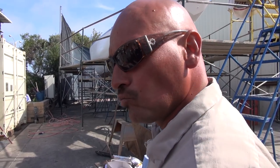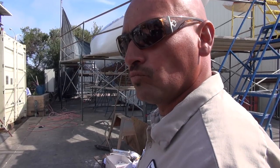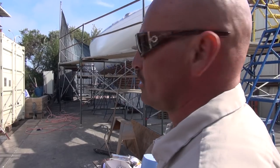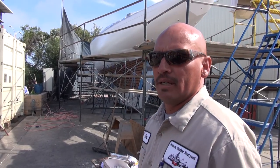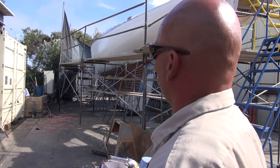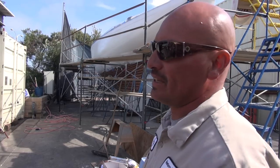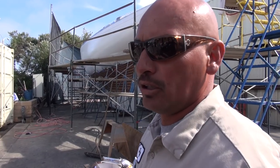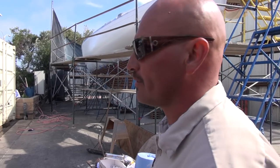So what are you looking for? You're looking for those little imperfections and showing him where he needs to add more paint? Yes, I'm just watching his overlap on his 50-50% overlap. So when he comes around that way, everything's even on the side of the hull. We have even coats. Okay. So we know everything's even. So when we block through it, say we burn through the primer as we're blocking through, we know we got a low spot or a high spot. That's how we identify it.